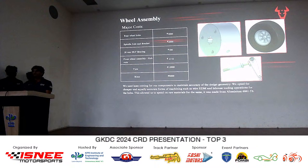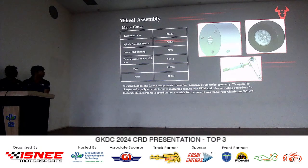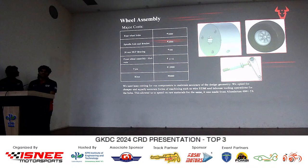We have also saved money in the machining. Initially we were supposed to use a milling machine or a 3-axis CNC. Instead we have gone with wire cutting for the splines, and we have made through drills to make sure they stay in place, rather than making circular grooves on the axle. This has significantly reduced our cost. Our spindle axle and bracket have also been partially sponsored. The laser cutting of the Ackermann arms and all have been sponsored by another laser cutting firm that has helped us throughout the journey. And we have been able to get our cost down quite significantly.